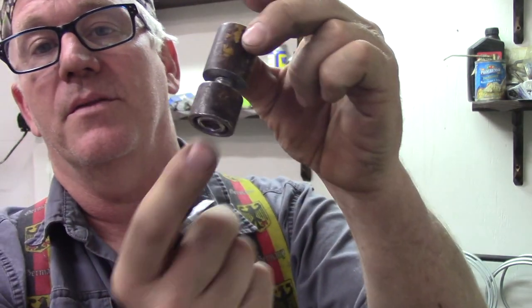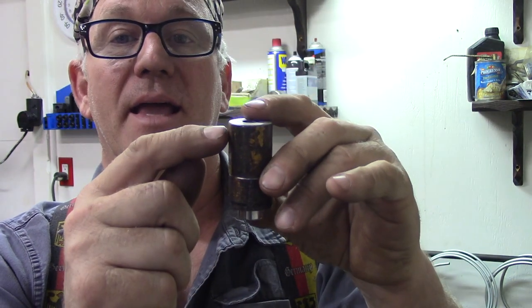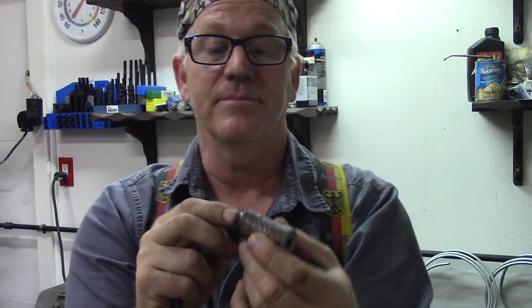And, you know, that'll hide that, and that'll go together, and I'll put the two pieces of the 5/8 stock going down to the head. And I can sink this into the frame really deep and get a nice tight weld on there with the TIG welder. So that's what we've got. And I fear that I'm going to have to take the motor and tranny out of the bike to get a hole sawn there to get this piece of stock to fit. But so be it. Let's get on out there and see what we've got to do.